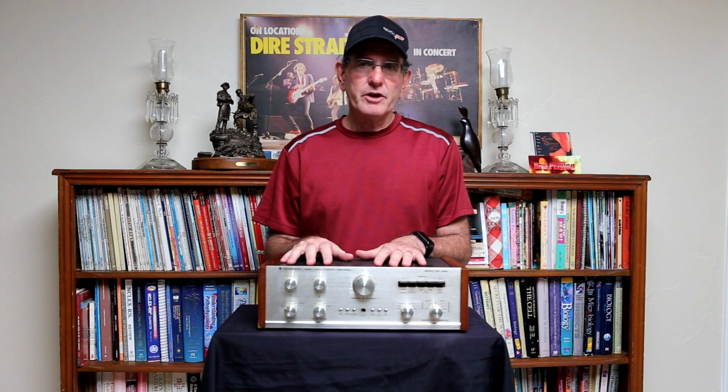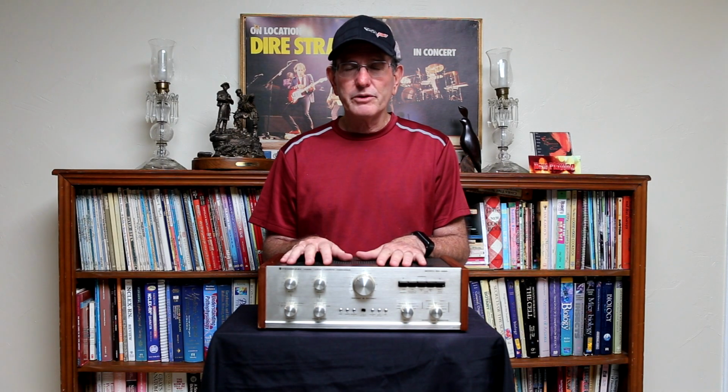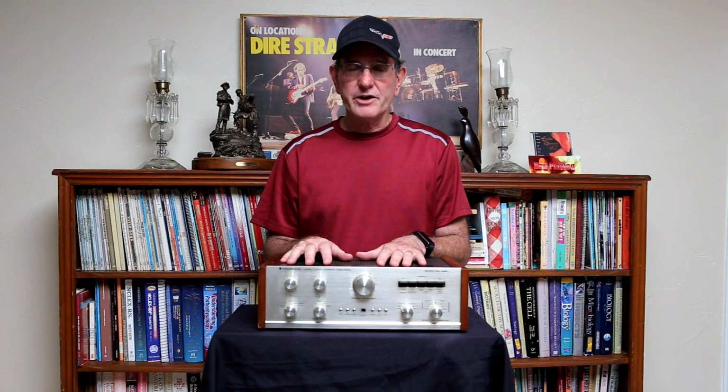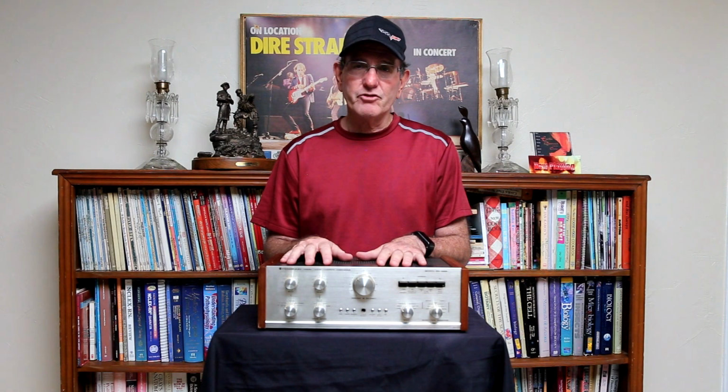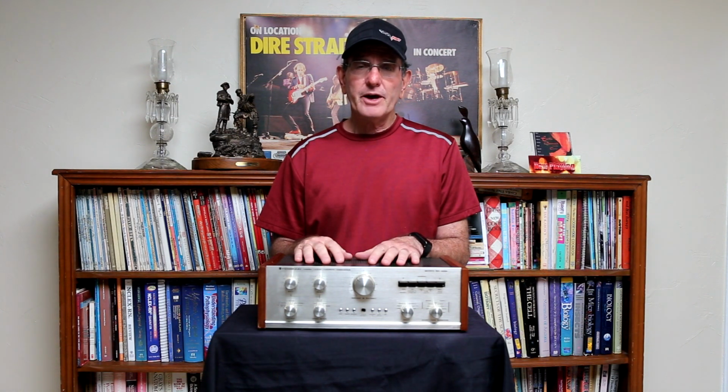But there was the whole main board that had a bunch of capacitors that related to the power amp that I didn't touch. And those filter caps I didn't touch because there was no ripple on them. I'm not somebody who believes in just replacing capacitors on a device because it is of a certain age. That being said, there is an adjustment for the phono preamp's RIAA equalization curve, and I checked it and it was fine.